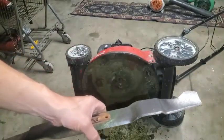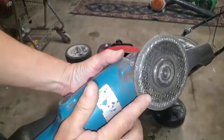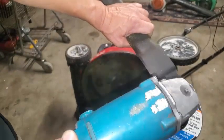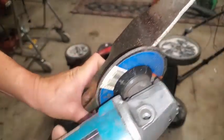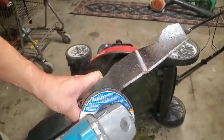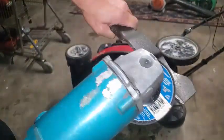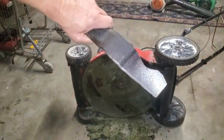I'm going to go ahead and use my handheld grinder with a grinding wheel on it. I just got this old electric plug-in grinder. It's got the grinding wheel on it — and it's not a cutting wheel, it's a grinding wheel. The grinding wheel is a little thicker and they're meant to grind stuff flat. In this case we're going to knock out the hills and valleys and get it flat, then angle it. Make sure it's a grinding wheel and not a cutting wheel — a cutting wheel is very thin and it's meant to go through metal perpendicular, whereas grinding wheels take off material quick.